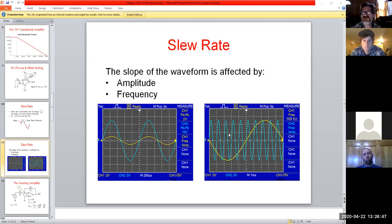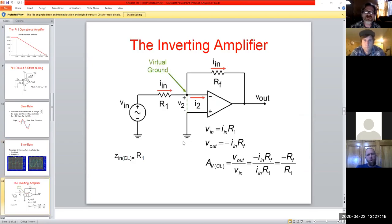But essentially, that's what you want. You want to experience no clipping, right? And you don't want any distortion on the rise or the run of this thing at all here, if that makes sense. Because in some cases you might have a frequency response that would affect along here, or we could get clipping where we affect the amplitude of the signal, if you will. But here we reproduce a signal, nice, clean, smooth.